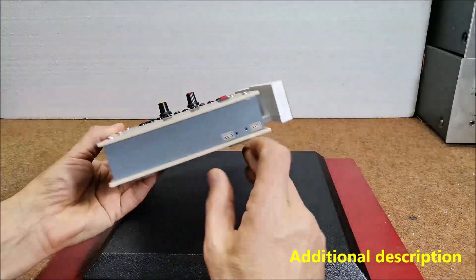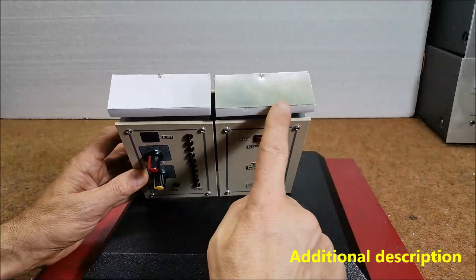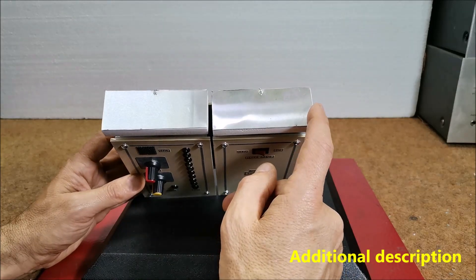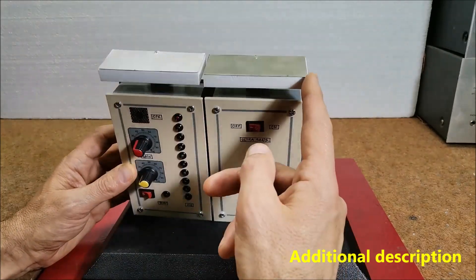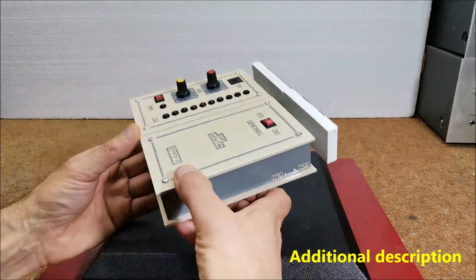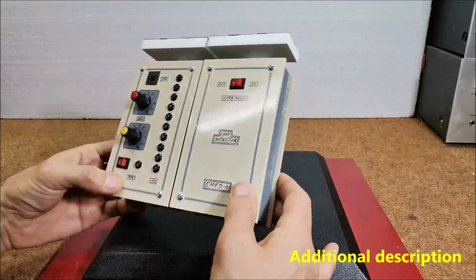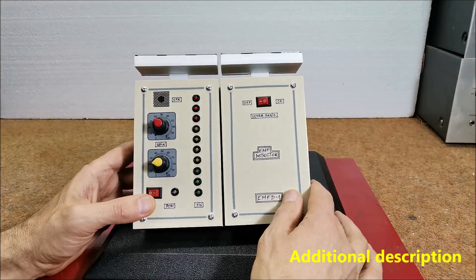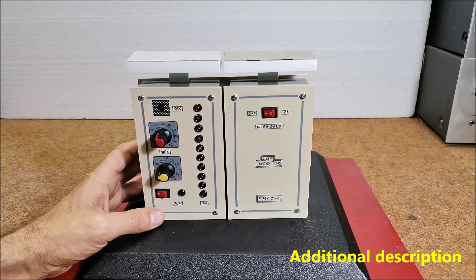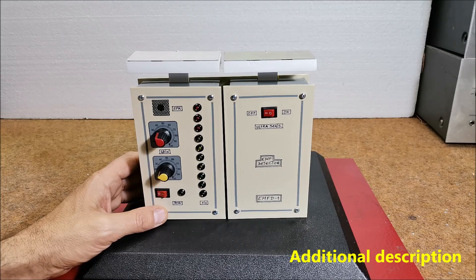I left a place where a custom antenna can be connected. After a short test I created my antenna as the best in terms of sensitivity and compactness — in my case it is a small aluminum plate with dimensions of 7 by 3 centimeters. The detector also has a place for connecting an external ground, which further increases stability. This device can also be used as a lightning detector, and in that case gives the best result with a wire of about 50 centimeters as an antenna.